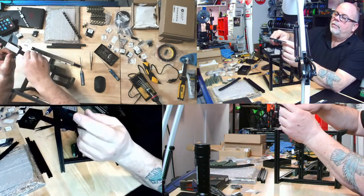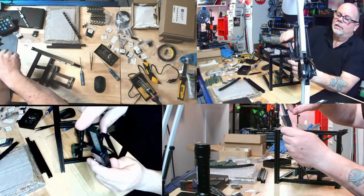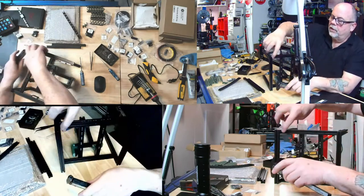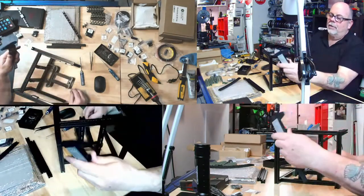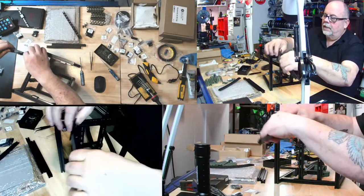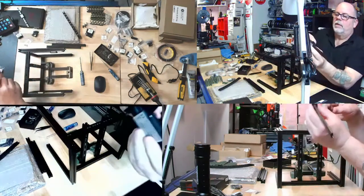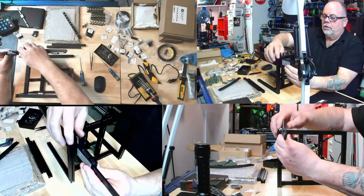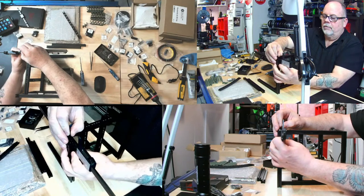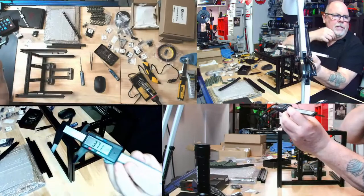So the offset is measured basically from the back of this. So if I want to measure to the top of this, I zero there, and I want to measure from here to here without guessing. Basically, I bring my caliper so the bottom of the inside one, then I just push this until it stops on the rail. Okay, and there's my measurement, 37.1. And they want it to be 37. I'm not going to argue over 0.1.